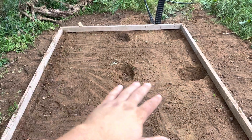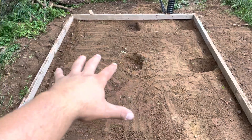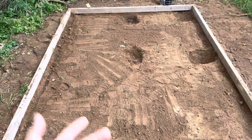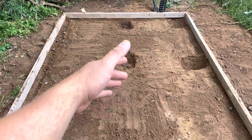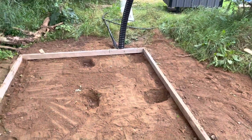I did about four and a half inches of concrete on this, and then where the legs go I just dug down a little more. With this size it comes to about a yard of concrete — just under a yard — and then with the holes to thicken the pad where the legs are on the wood boiler.